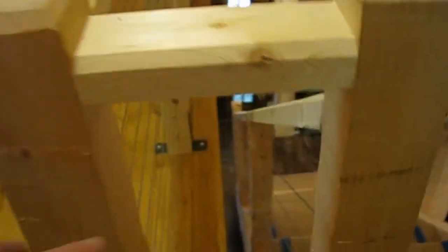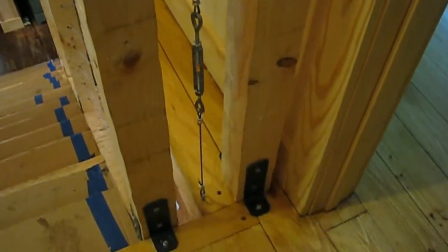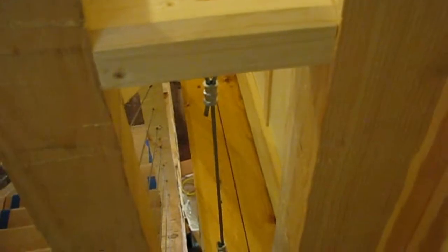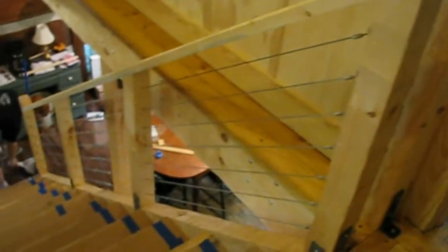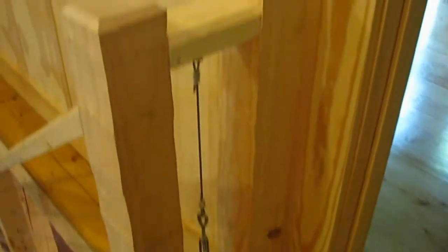You can see on these short runs, we're just going to put two vertical ones under here. We need to fix the floor to accept them. Over here, we've got that one in. Just because there's no way to really get that horizontal run in there. All we need to do is get this less than four inches to meet code, and we're set. There's no reason to spend a whole day on putting ten rows of rails — there's not even enough room for a turnbuckle in there. So anyway, it looks good.